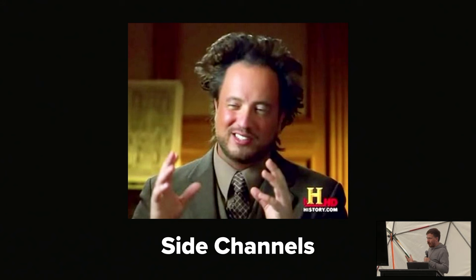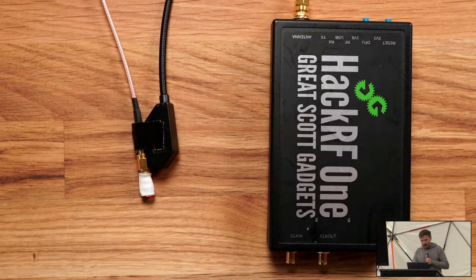If we mess with it, eventually the traces will diverge, and that's where the boot fails and where we can potentially glitch. Normally, you would use an expensive oscilloscope for this and a nice near field probe. I used a HackRF One, which is, you know, not $4, but you've got to be flexible. And instead of a near field probe, I just use a very cheap coil, because near field probes can easily run you hundreds of dollars just for this.